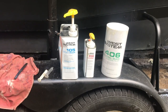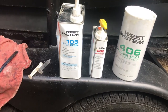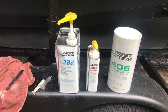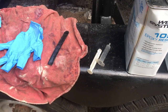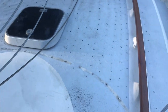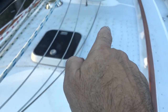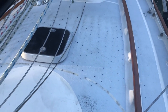For the epoxy, I'm using West Systems, slightly thickened with 406 but not too thick, because I need it to seep into the voids. Injecting it with a 10ml medicine syringe. All the holes are now filled — that took quite a while because there were a lot of voids in this area and even further up — but I got it filled. Let's see how this looks tomorrow.